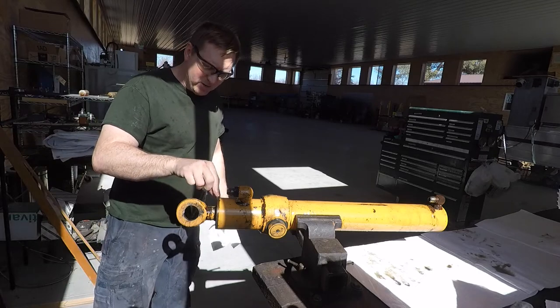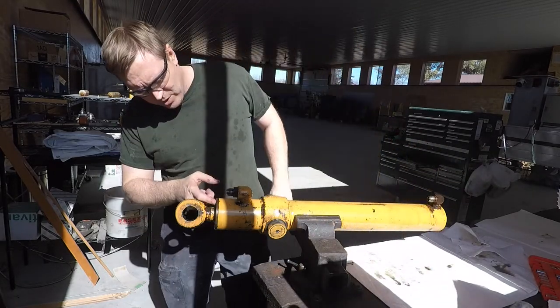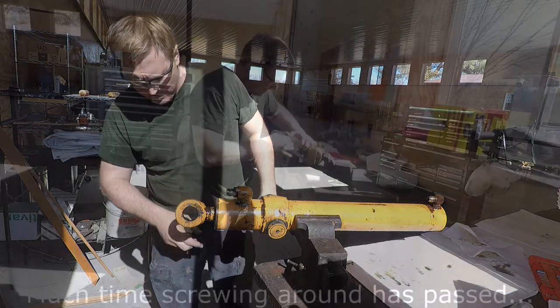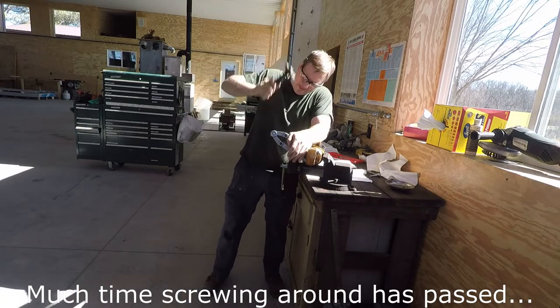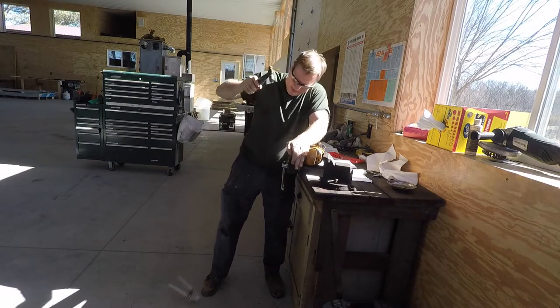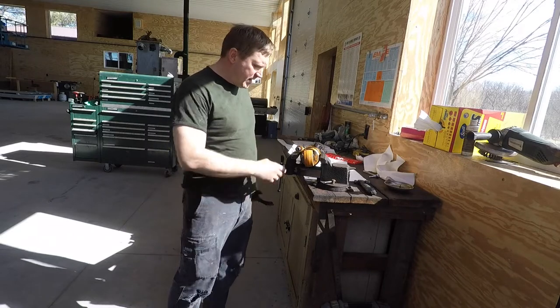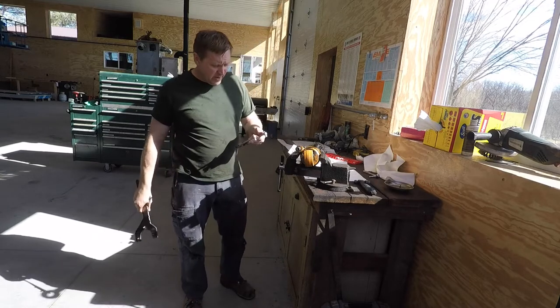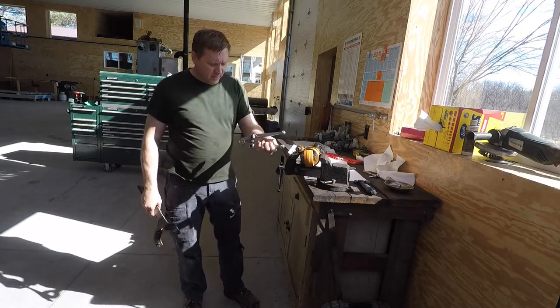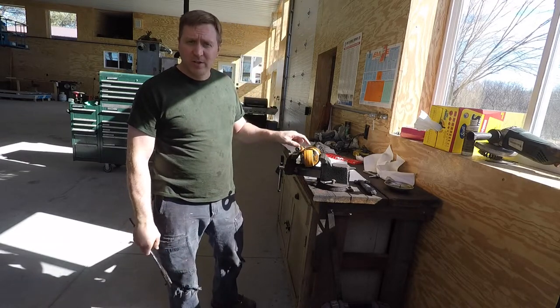So there's a screw here to keep the gland from spinning, so that's gotta come out first. Now this is drilled for a face spanner. It's got pinholes here in the front. Well, after messing around for quite a while here, I can't get this to come loose with this adjustable spanner that I have. You just don't have enough length to get the torque on it, and the pins pop out. So I'm going to make a spanner wrench for this, a custom one.